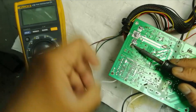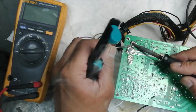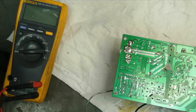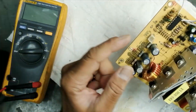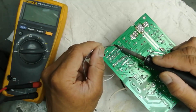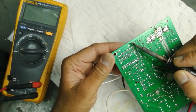We can turn this power supply into a standalone unit and use it for many purposes. In the first step, we deal with the power-on command — the PS-ON signal. You have to make a jumper with ground so this power supply will go directly into the power-on state. So we will make a jumper.